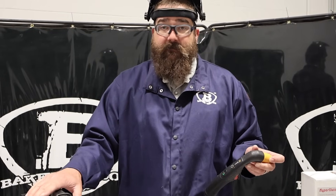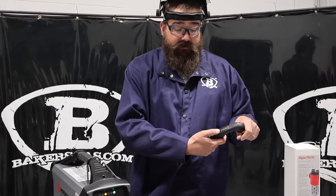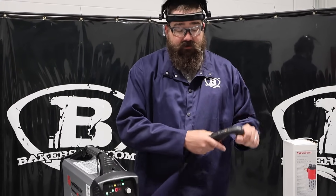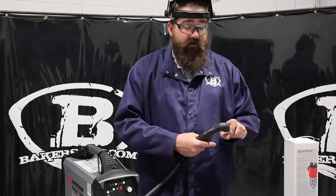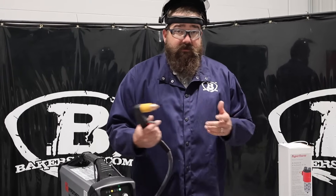This unit will do 9 to 45 amps, but with this consumable in there it'll go down to 20 amps, all the way up to 45 amps, and we can control it with one click of the button. It's got a lockout system so you can lock it out, change the consumable, go to the next consumable — you've got to change out quick. The operation is awesome. If you mess up a consumable or it goes bad, you can pop it, slam a new one in, and you're right back to cutting.